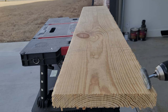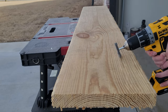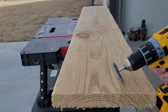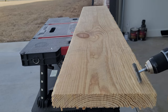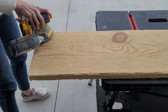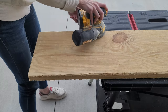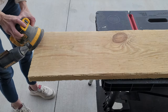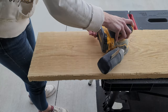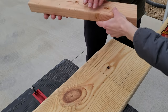The third step is using this metal brush — it's an attachment for your drill gun. It's a two inch metal bristle, and this was actually a lot of fun. There's no rhyme or reason, I'm just putting grooves and making some worn out spots. And then finally you're going to go ahead and sand. This is getting off all the rough edges, smoothing things out, adding another layer of aging your wood and distressing it — wearing it down, smoothing it as it would be with normal age. I started with an 80 grit to really rough it up, then I did 120, and then later on I did 220 after staining, which we'll talk about later.